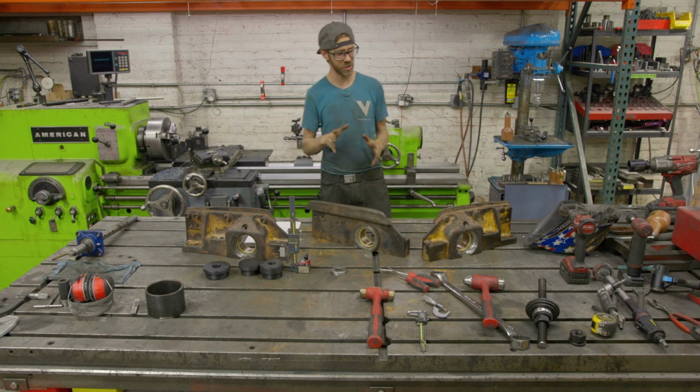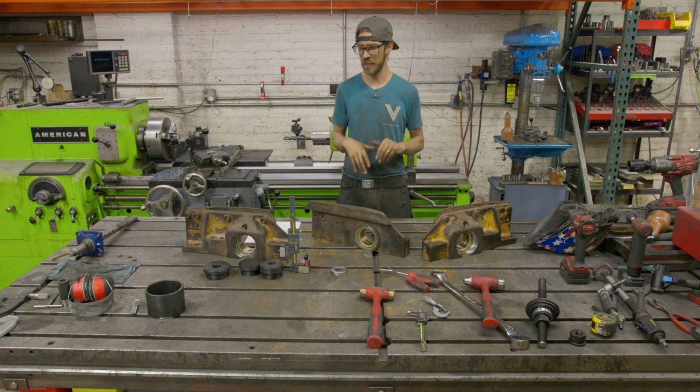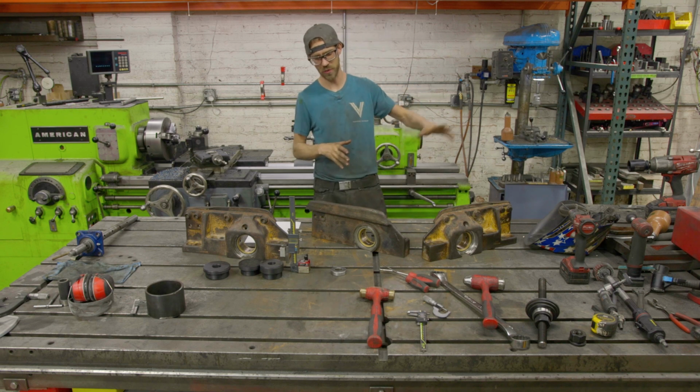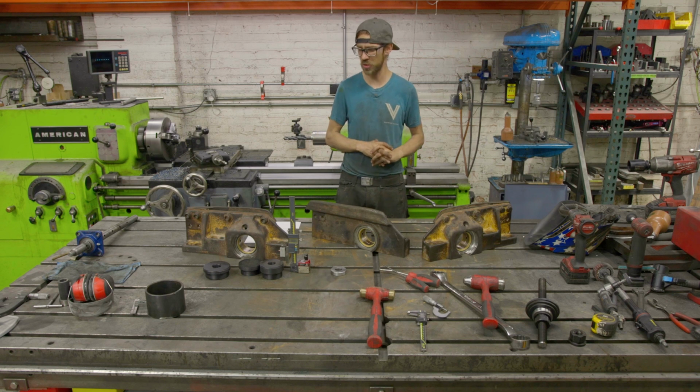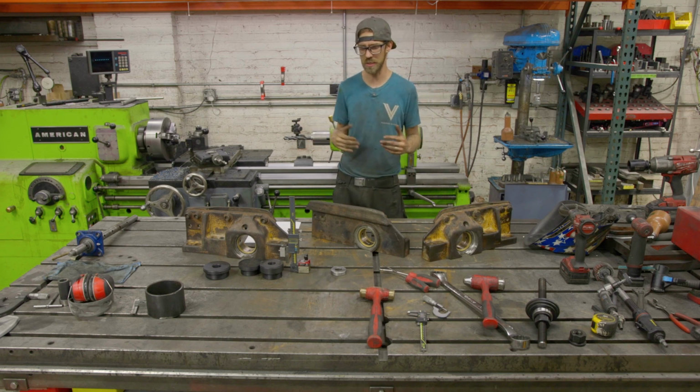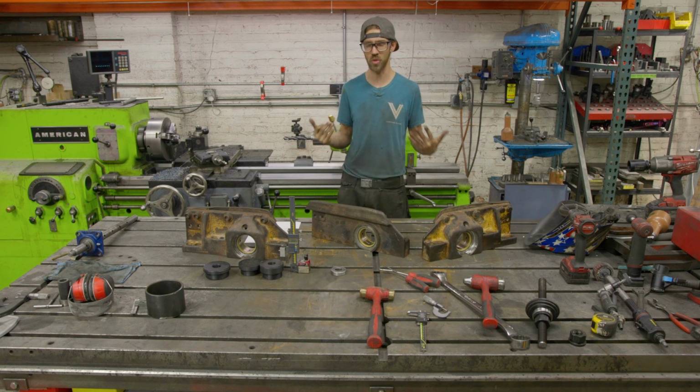Measuring. So measuring these out was a problem. Now, when I did line boring last week, I was using a WS2 and I was doing a boom stick, and that kit has those little snap gauges that you've seen Curtis and other people use. Those work pretty well, and that's what I used. It's nice, you can get it into the bar, you can get an accurate measurement, and continue on.